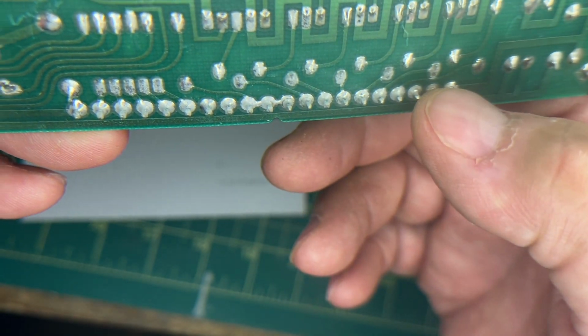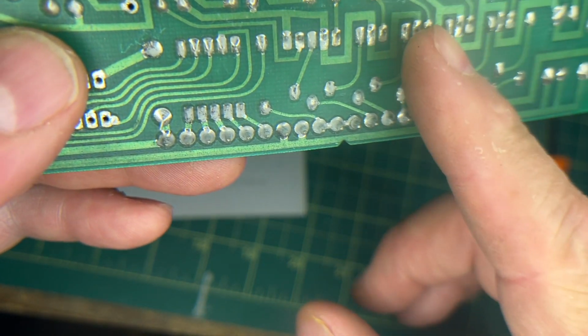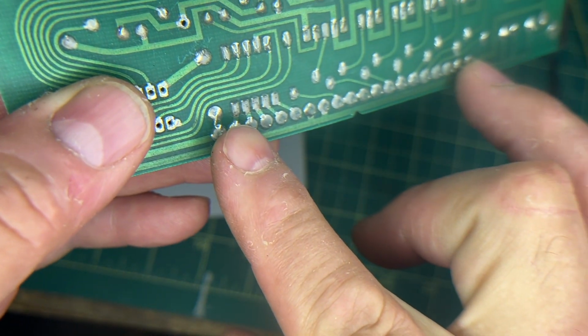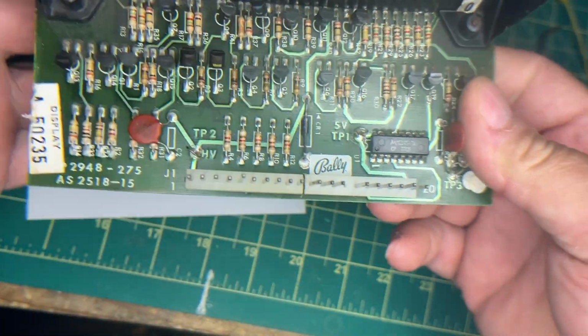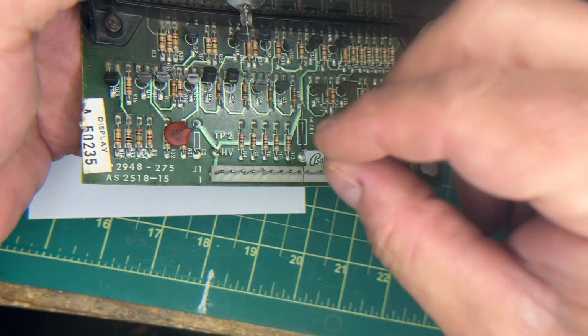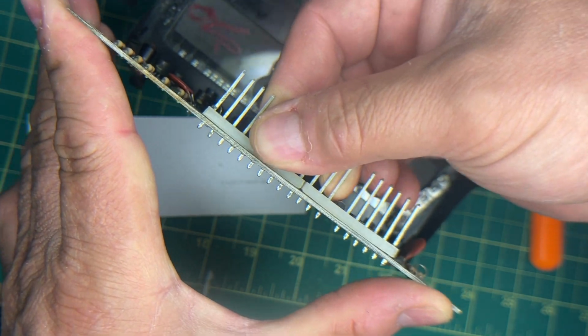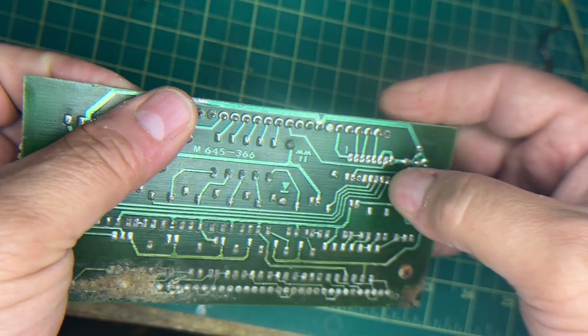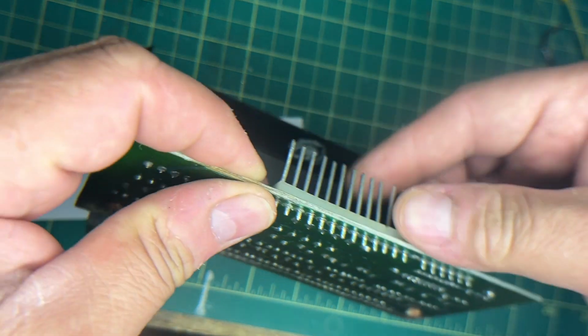And this one's not too bad. I've seen some where they're completely broken. And typically with these, it's the outer ends that break. Because what happens is when you pop a display in, it flexes. Like you push the wiring harness down on it, and when you push it down, watch, it flexes the board. And this flexing loves to break, especially the outer pins. And case in point,